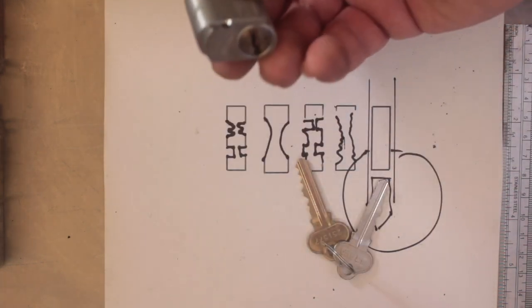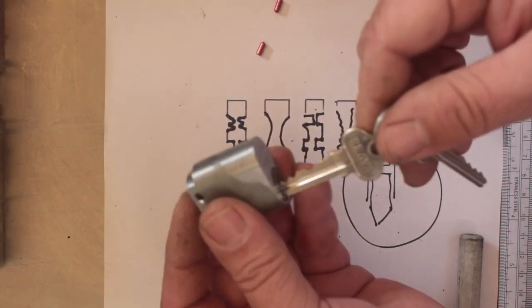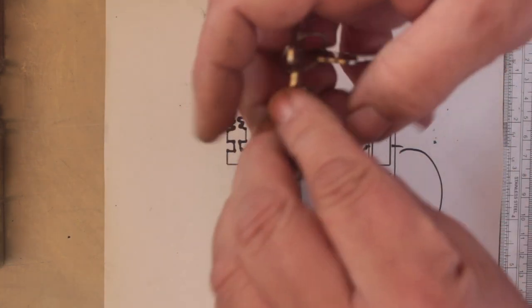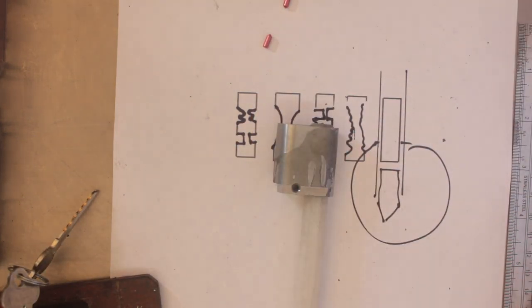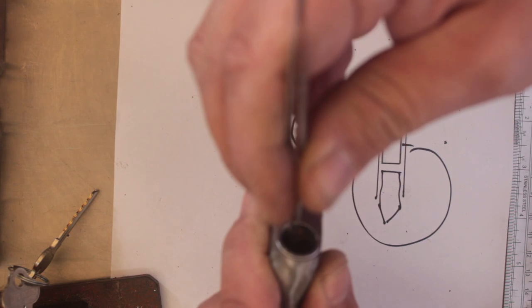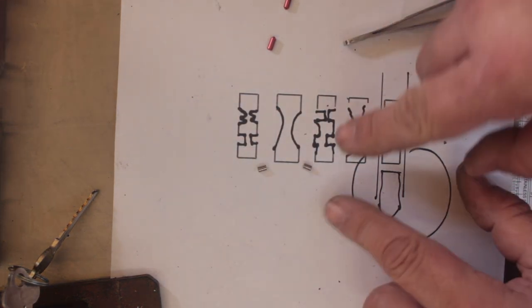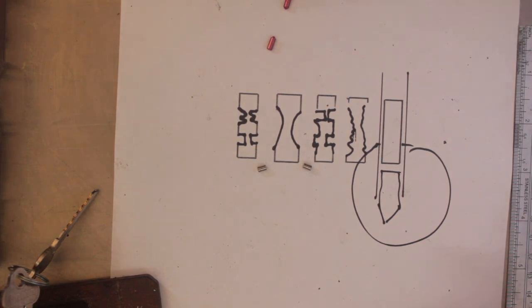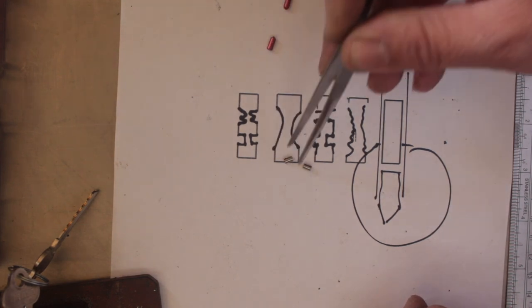Now that I've got the plug turned — or you could have used the key — put your key in the cylinder, turn it a quarter of a turn, make sure none of the pins are going to fall into any funny spots. Follow through with your follower, take your plug out, and sit it over here. I'm going to start at the back and drop the last two pins to show you what difference it makes with just two pins. I'm going to use two number nine pins out of a standard pinning set — they give a bit more room to make the shapes and trapping cavities I want.